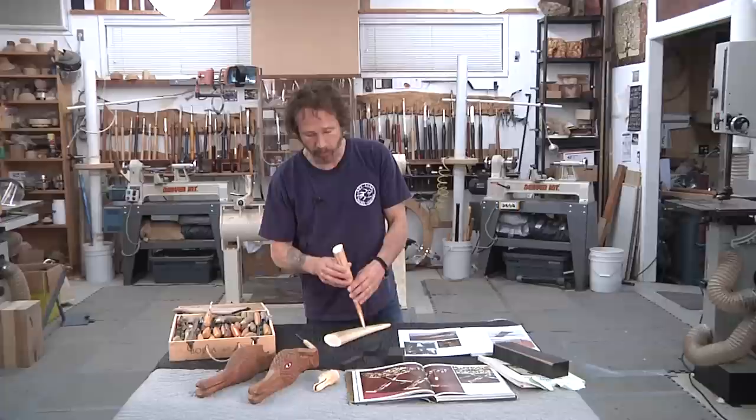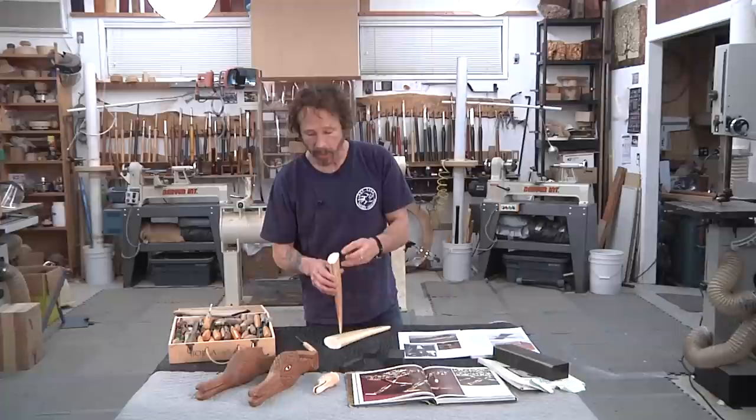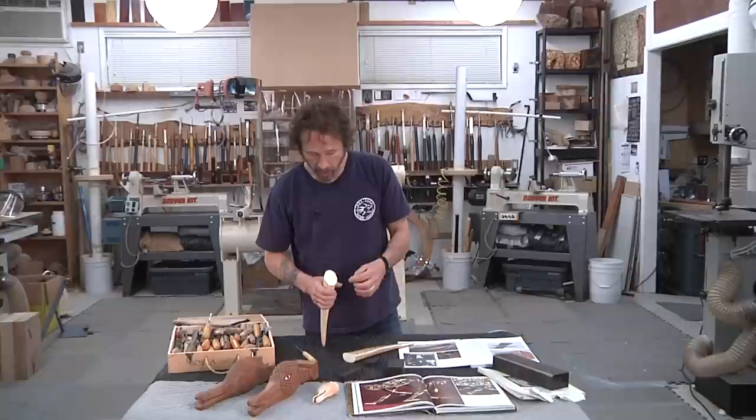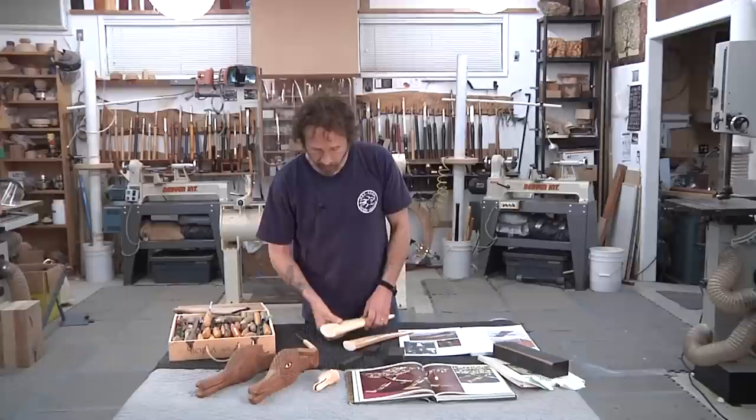Now, when you're dealing with ivory, there's two types of dentin. There's the primary dentin, which is on the outside, and the secondary dentin, which is on the inside. And for this one, I really wanted to have that white color, so I went for the primary dentin, which meant taking a slice off in the bandsaw and then just capturing that outer white area and then inlaying the ivory into that.